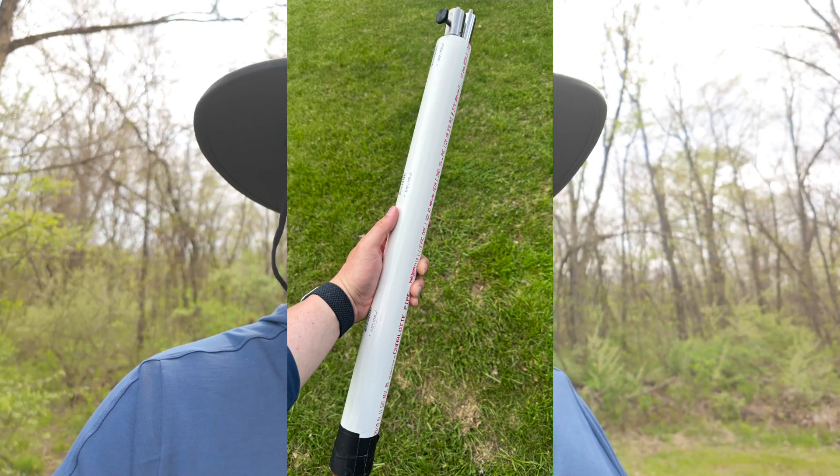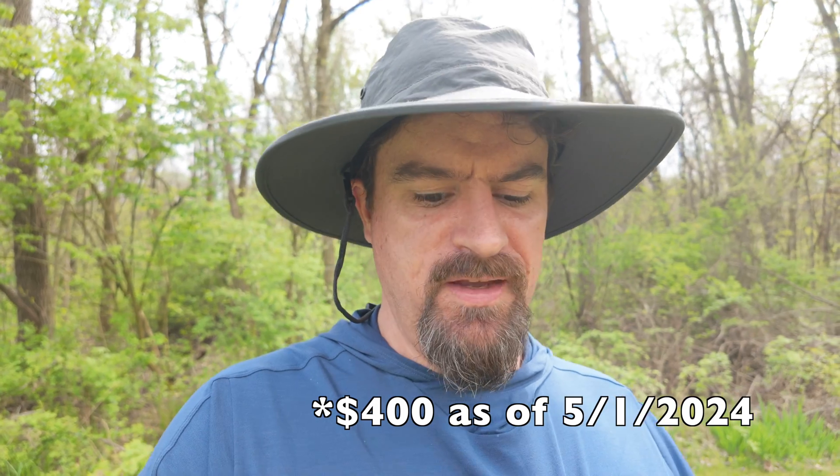There you have it — two park activations with the Chameleon Delta Loop. I recommend this antenna. It's super easy and super portable. The 17-foot whips take up quite a bit of space; I have just a piece of PVC pipe with a cap on the bottom to keep everything together with the spike. I think it's pretty portable, just like their vertical antennas. Of course, it's a Delta loop so it hears really well and it gets out — but it's broadside, so keep that in mind. It's about $500 if you want to buy it from them. With the Hybrid Mini, it's 500 watts sideband, 100 watt CW, and 50 watts digital. That's more than enough. It covered me all the way up to 40 meters, and you only need a tuner for 20 meters and lower. Until next time, 7-3.